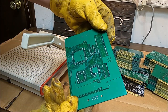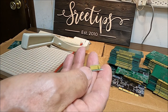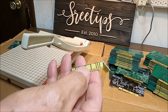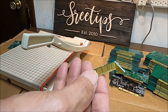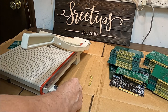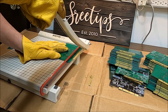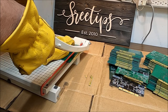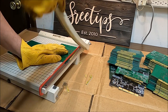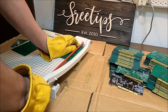This is going to be scrap. The only gold on there is the gold plating for these fingers — it's very thin. But if the card didn't have that gold coating, that's where it connects and plugs into a slot on a motherboard. If it didn't have that gold coating then the computer would fail and stop working in about a week due to corrosion. These things are on there to prevent corrosion and to make sure that continuity of flow of current or electricity goes through and gets to the cards to do what it's supposed to do.